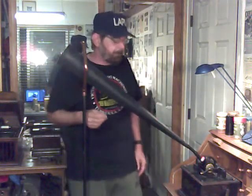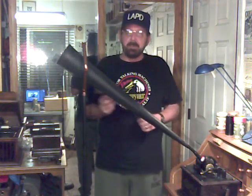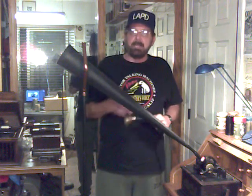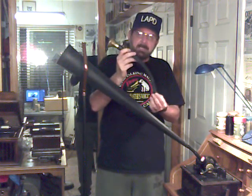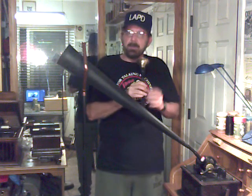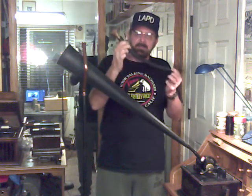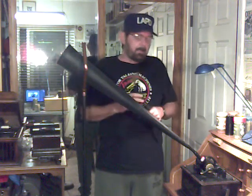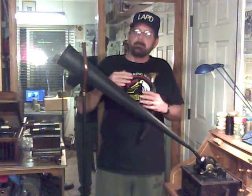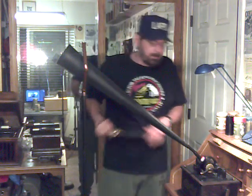The difference between a speaking tube and a recording horn: a speaking tube produces a very loud, crisp, bright, precise recording of the voice, because the entire recording process is powered by sound waves and air pressure. With a speaking tube, the distance and diameter are very small, really concentrating those sound waves on the diaphragm. However, it only captures short waves — it cannot capture bass waves, which are long. So a recording with a speaking tube will always be higher pitched and louder because it has no bass waves at all.